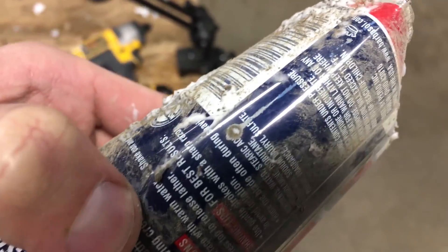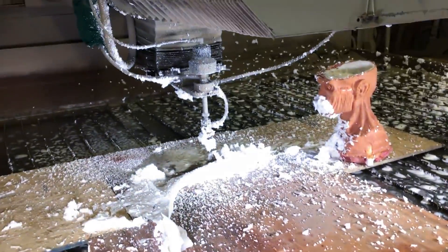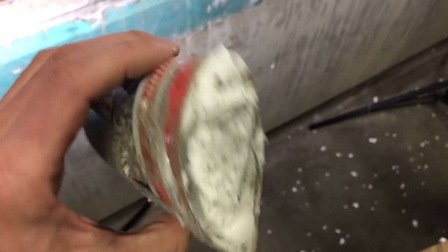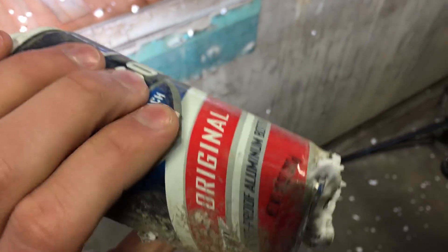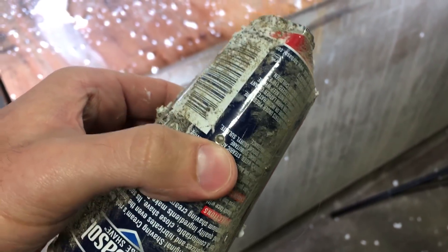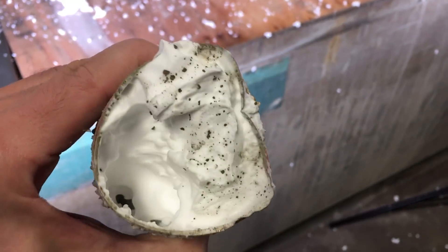So we think this is what happened — right there it looks like a BB hole, that's where the water jet was hitting it. There wasn't enough pressure inside the can to make it really do anything, but the water jet — like the 60,000 PSI coming out of there — filled the can up more than it could hold, and that's what blew the bottom of it off. Because the water jet never came out on the bottom, we did just water only on that one, that's why it didn't cut through it very fast. But the pressure from the water jet is what made that can unfold.